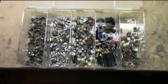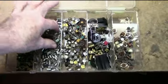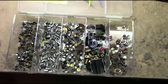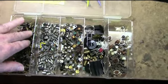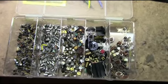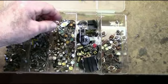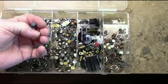Well, as you pursue this hobby, you're going to end up with a lot of parts that need testing. Some of these go way back. Here's some old germanium transistors, in fact, which is the reason vacuum tubes held on for so long. But I've got shoeboxes full of these things, and you need a way to test them. So either use your DMM, or if you can get a curve tracer, that's the way to do it. But I have no trouble using used transistors in a circuit, but I always test them before I actually use them.